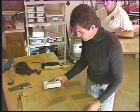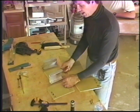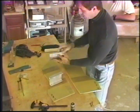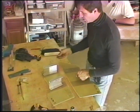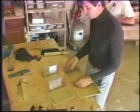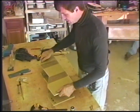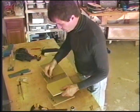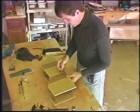Three bolts. They go this C-section facing aft, this C-section facing forward. You can tell by the joggle on the bolt line and this bolt line. That's how it's going to go. They'll only go one way. We're going to take this, put it on top, and the bolts all through. We're going to run 2 bolts per position.